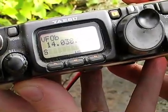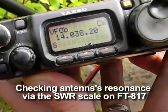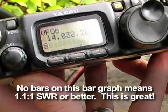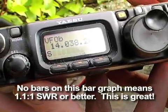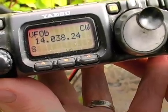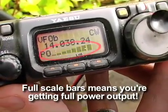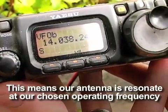So we just set up the antenna on 20 meters. I'm checking the SWR with the meter on the FT-817, just using the mini keyer on the side here. Not showing any bars there, which means the SWR is essentially flat and I'm ready to operate. The other way to check to see if the antenna is resonant is to use the power meter — just making sure that you get full power out. The more power bars, the better. And that's showing that we're essentially getting all the bars out, which is a good start.